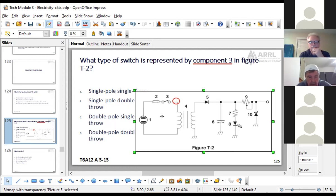the two. So they're not hooked up together, but they share a magnetic field. So this induces the magnetic field into this. And because we have alternating current, it's going on and off, you're having the fields going on and off, and turning this into alternating current.